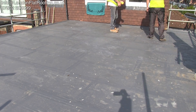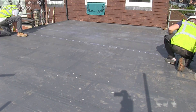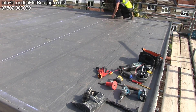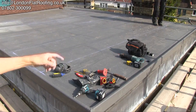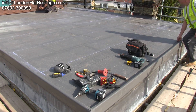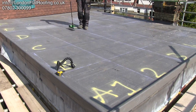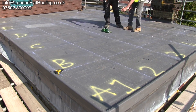This was a really interesting roof for us to demonstrate how we can do electronic testing of a roof to find if there's water inside it. We already know that this roof is a warm roof and there is a hundred millimeters of insulation underneath us. We chalk line out a grid over the top of this and this will be the basis of our moisture map. We'll be able to reference any one particular square inside this area on a drawing at a later stage.